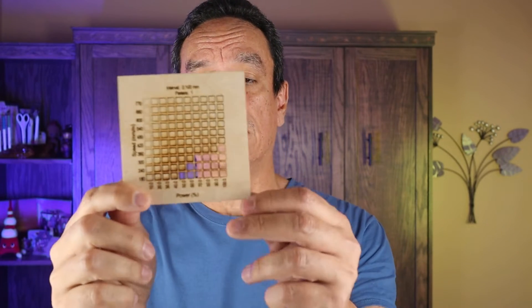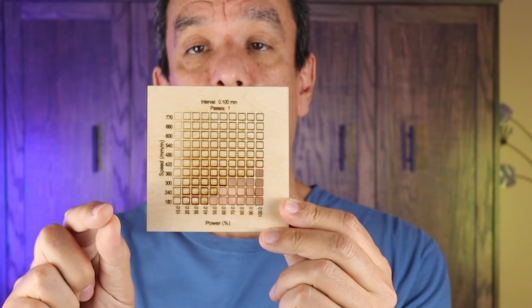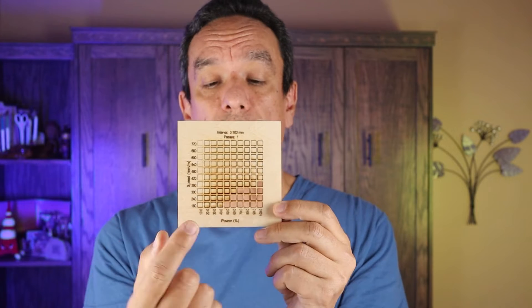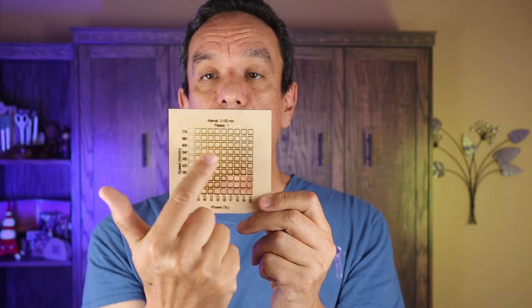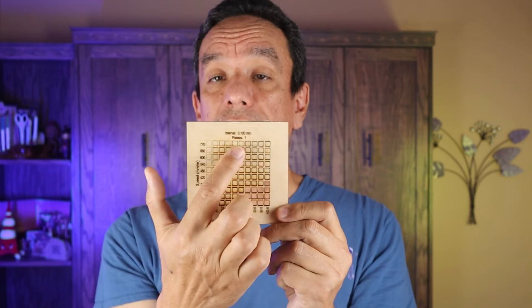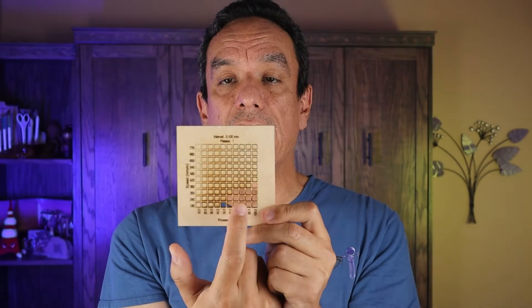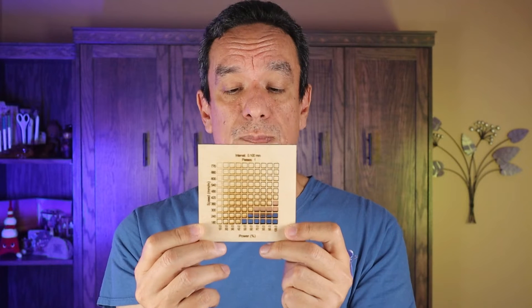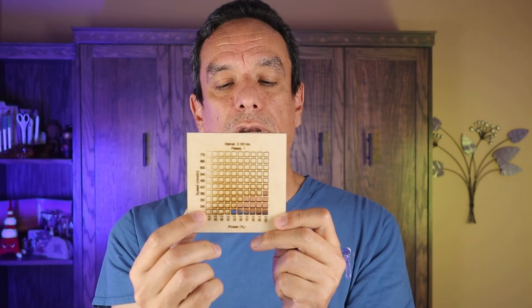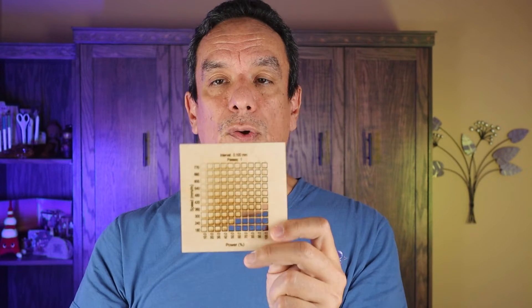Here are the results from the cut test made using LightBurn's testing grid. If you use high power and slow speeds, the laser stays in one area for a longer time at stronger strength, and you start getting a lot of burning as opposed to a clean cut. As you look at the grid you'll see different speeds — speeds that are too fast with power too low don't actually cut through. On the back you can see it didn't even make it through the wood. But using this test you can see which ones have holes, meaning it cut through. You want to find a clean cut using as little power as possible with no charring — using less than 100% power puts less strain on your laser and should make it last longer.